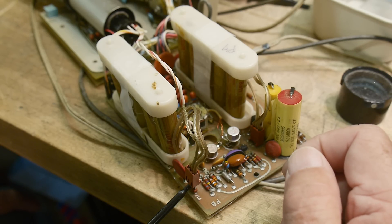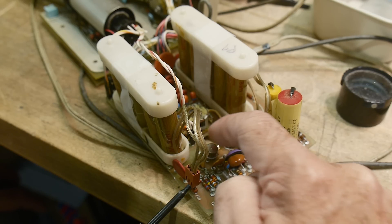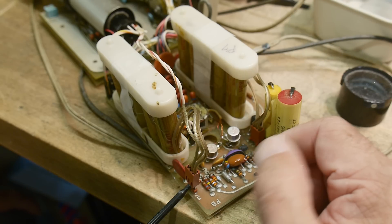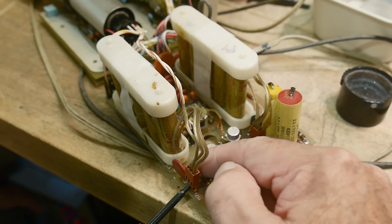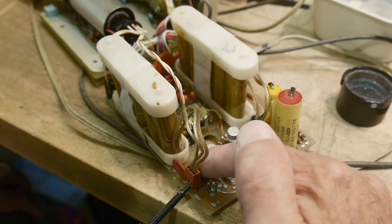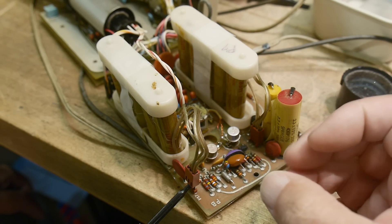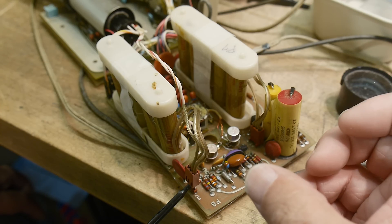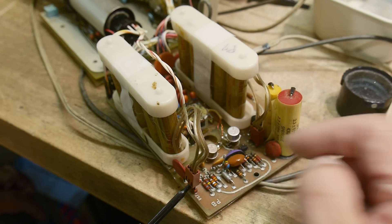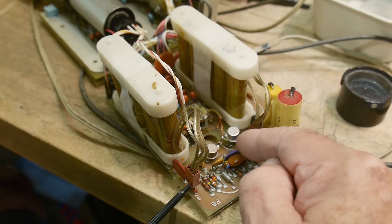One of the thin wires looked like it was about to break, so I resoldered it. I pulled out both transistors and put them on a tester — they test okay. But when I pulled this little one out, his leads were completely black, completely oxidized. That's probably why they went ahead and soldered it over on this side. Both transistors had originally been on sockets but have now been globbed in with really poor soldering.